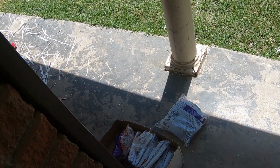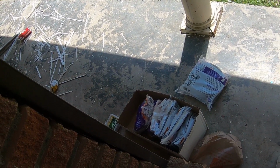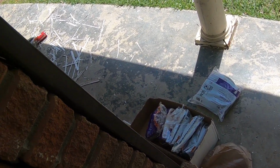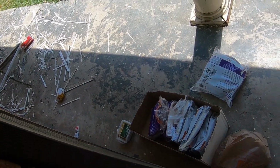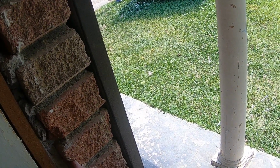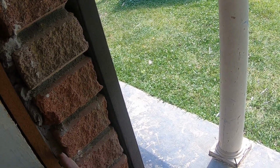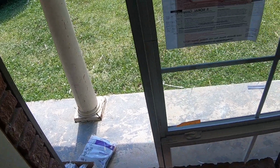But I'd like to try to get into that wood, and it feels like this is just a piece of 3/4 inch material ripped down, some old fascia or soffit when they were building it, to bring the window out a little further so that it wasn't way back here, because they brought it out 3/4 of an inch. You can tell by the caulk line on the window that the old window was right here, and if this spacer had not been there, the old window would have ended up right here, and there would have been a little issue with that.